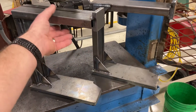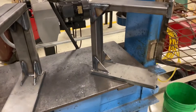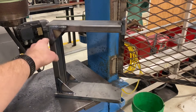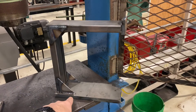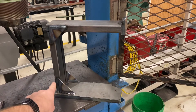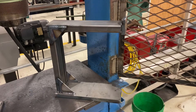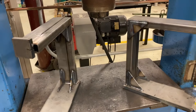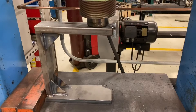If we come over to this next one, you can see I did the same exact thing on the same exact tubing. I left the top joint completely unwelded, and then I just welded up the gusset on both sides. Same with the bottom on this 5/8 plate — I did weld the tubing all the way to the plate and welded one side of each gusset. We will start with this one first and put it under the press and see what happens. This is the best part of the job sometimes. It's time to put Bender to work. I have this 50-ton ram placed right at the end of the tubing to put the most stress on those gussets. We're going to activate the pump and start seeing where those stresses are placed on that tubing and where this part will fail.